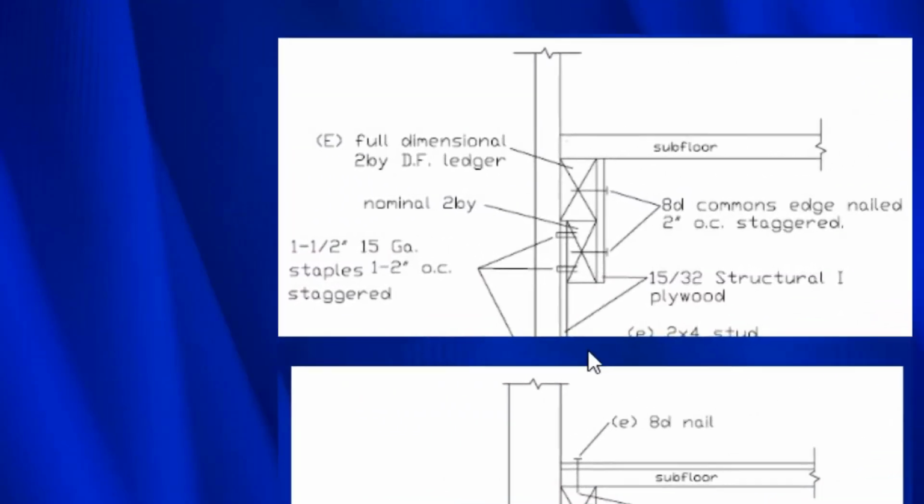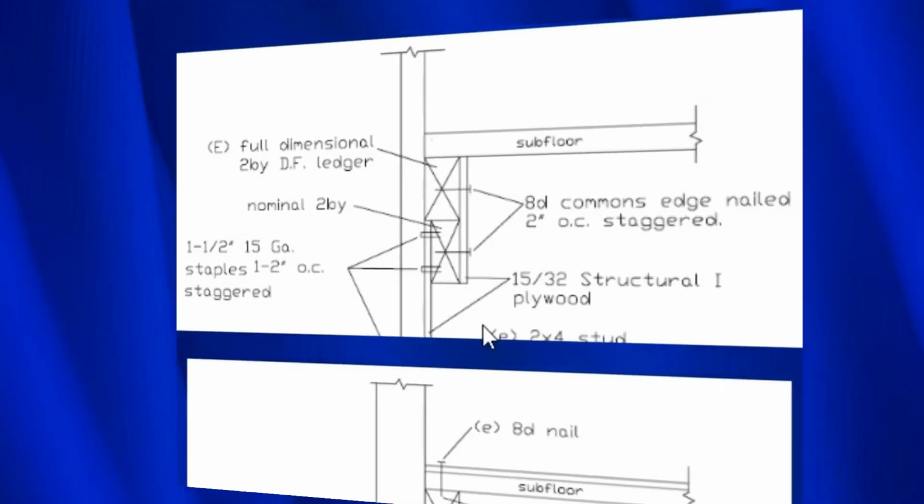Now this one is extremely similar. Here we have the exact same situation, except here we have the piece of plywood. Then we have this 2x4, which is 1.5 inches, and because it's 1.5 inches plus this 1/2 inch, we're the exact same dimensions as this old growth 2x right here, and now they're in the same plane, and we can just go ahead and put a piece of plywood right there, and we're all done. So this is a very good option for dealing with balloon framing.